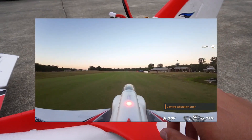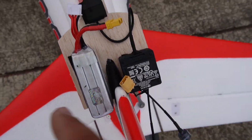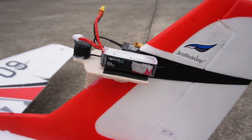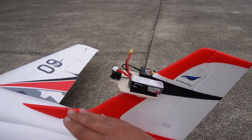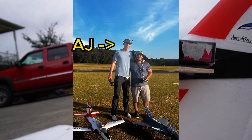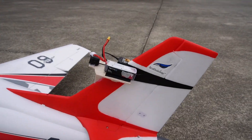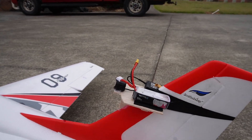The only material we used is a piece of balsa wood that slides over the tail like this — there's a V cut in there so it slides over the rudder. We lined it up right with the black stripe, got it as level as we can. One issue we thought we'd have is that this is basically like a big wind sail, so we were worried it would get pulled up and off. AJ took a 90-degree piece right here to give it some structure, which helped a lot with vibrations. We had a little bit here and there, but that's mostly from the rudder — just some flex inherently.